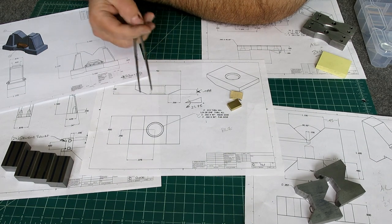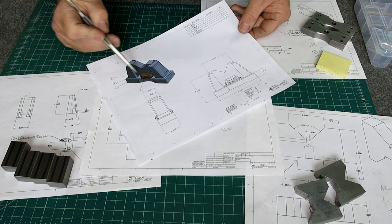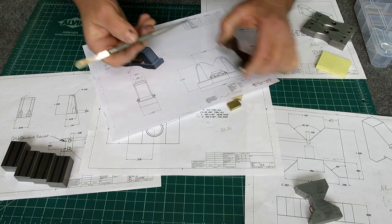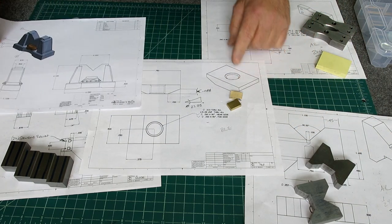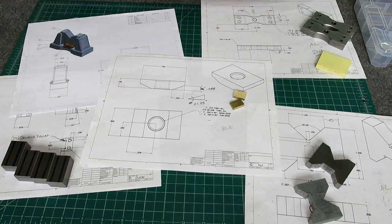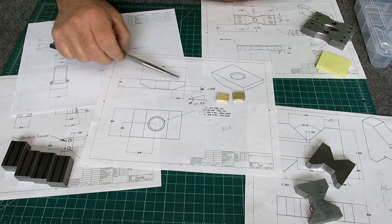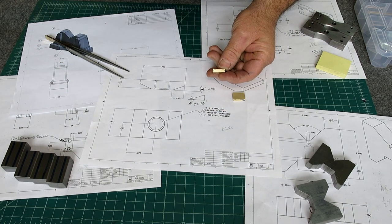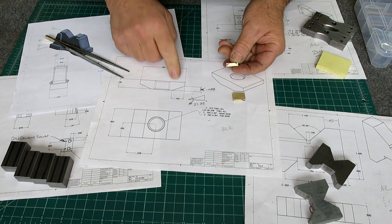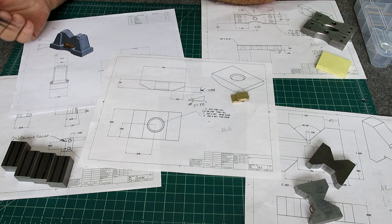This next one we're going to do is the nut — that's what I'm calling it. It's this bit right here in the assembly, number five. This is actually threaded for the knob and it fits into a little recess here in the V-block. You can see it's a small piece. It's got a kind of an interesting setup problem. It was designed as a training project. This small piece has some little angles on it — little reliefs underneath. It's kind of an oddball angle, and it could be almost any angle. It's kind of irrelevant — it's just to make it look more interesting, so these corners kind of come together and still leave some meat in the middle.